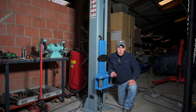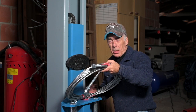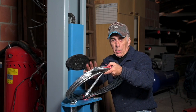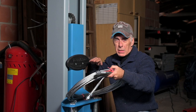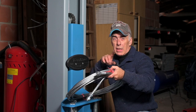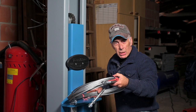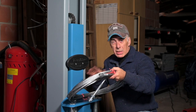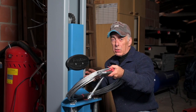Have a close look at your instruction manual for the cable run — it's clearly explained but I'll show it as well. We got two steel cables, and we will have to install them on the shuttle from left to right. The whole purpose of the steel cable is to run the shuttles in sync so they go up and come down at the same pace. That's why you need to lock it in its first position on both the left and right column, then run the cables. Once we have run the cables, we'll do the cable tensioning adjustment, and finally grease the cable.